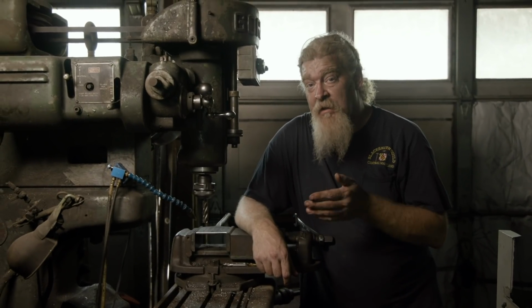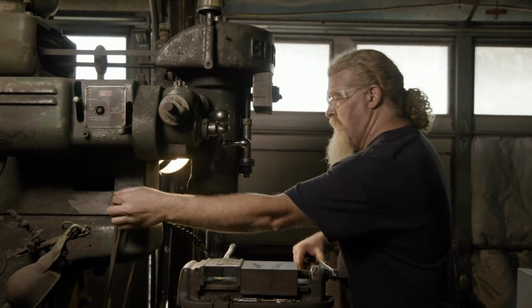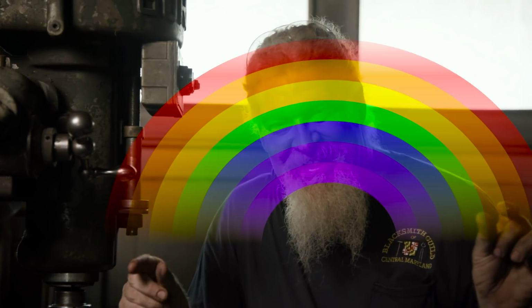Now that I've got the forging cleaned up, I just went over and decked it and made sure my sides were true, cleaned up my surfaces. I pre-drilled the holes down in the center just so that I can get this larger cutter and I can get a little depth as I go in case this is hard from forging work. But I'll get these slots in and then you'll be able to see how this thing's going to look and you won't have to use your imagination.